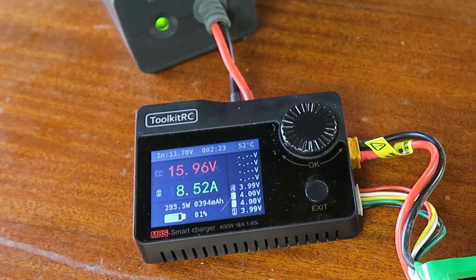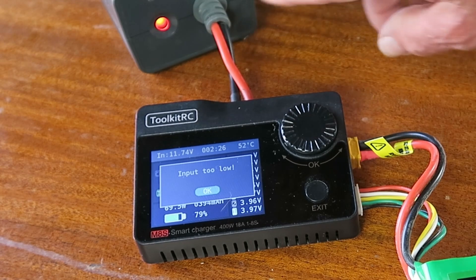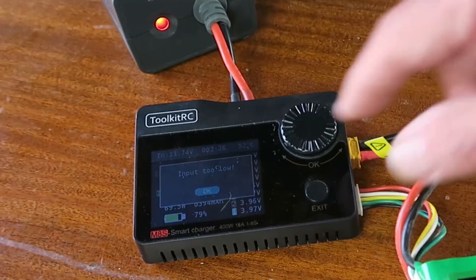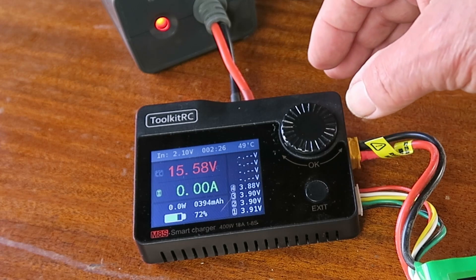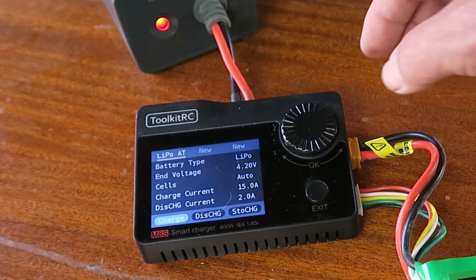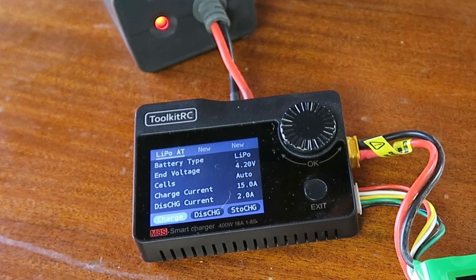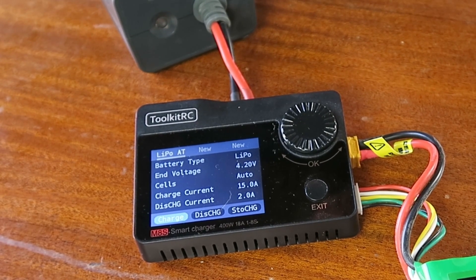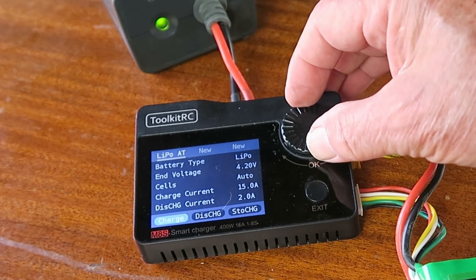The high-speed fan has now kicked in on the charger. Then 'input low' — we can see the LED on the Xbox power supply has gone red to indicate that it's in a fault condition and it's switched itself off. Sadly for you folks, there are no huge balls of flame or smoke or anything particularly exciting. It doesn't appear to have actually overheated — it's just gone into its alarm condition. If I remove the power from it, the red light goes out. Wait a moment... and it's reset back to the green condition.